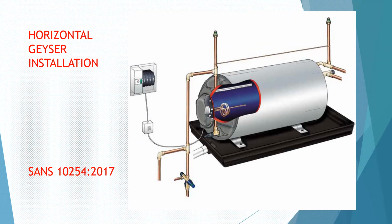Yes, there it is. So you go there, take out the 3/4 inch BSP threaded adapter, screw it onto the garden tap, screw the gauge into that, and you open that tap relatively slowly. You don't want to mess up your gauge. So you slowly open it, and you're going to see the gauge go up. If it stops, say for instance now at 900 kPa, okay, it can go up to 1600, but it stops at 900 kPa, then you know that that pressure is 900 kPa. Obviously, that stands to reason.